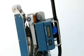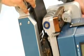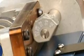Before using the Wedge It, adjust it to the desired thickness of material. Create 4 small pieces with the material you'll be welding. Cut a notch out of 2 of them for the air channel pin. Insert your cut pieces and clamp the cam to the desired thickness. In our case, 80 mil.